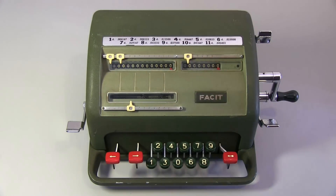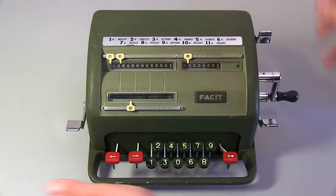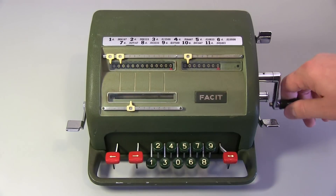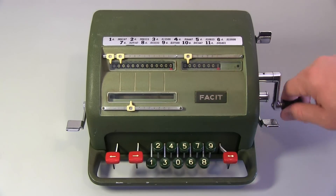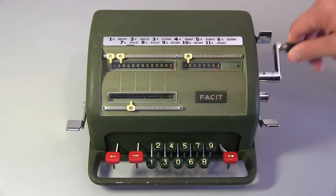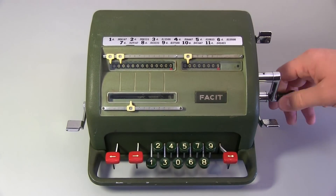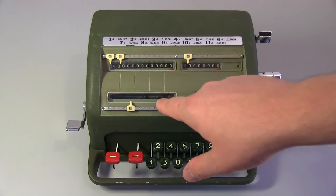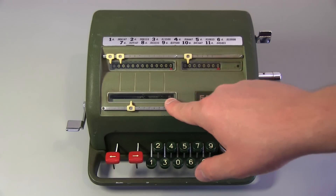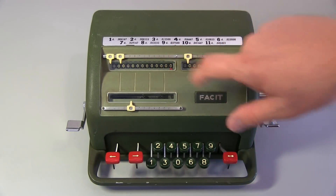The first mechanism to show on this calculator is the accumulation or the counting. Without anything set, with it all cleared and everything on zero, if I turn this handle clockwise, see it counts up one - this is the counter register. As many times as I turn this it'll just keep accumulating, and I can also go back the other direction. It basically does math on the setting or input register, does the counting, and then puts your result out to the accumulator.